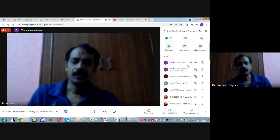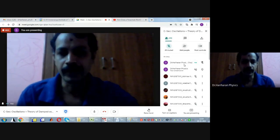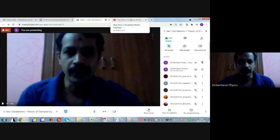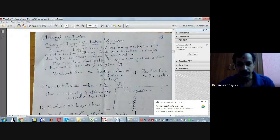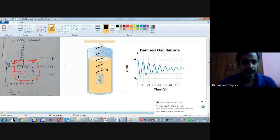Okay, what do we mean by damping? Damping means, as time lapses, the amplitude of the vibrating body will reduce and eventually it will come to rest. What does that mean? Look here, simple. In the earlier class, when we discussed the theory of free oscillations, we considered the body which was attached to a spring and it was vibrating up and down when it was displaced from its mean position.